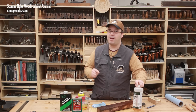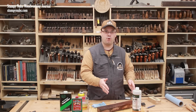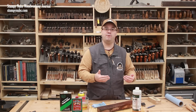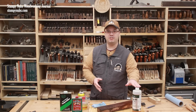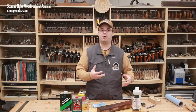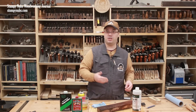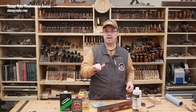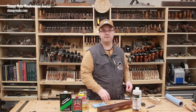Because they aren't talking about adding coats in layers to build up a protective film. They're talking about waiting an hour for that first coat to soak in, then adding some more of it until the fibers are fully saturated. It's not contradictory to what I learned, it's just confusing. This bottle describes essentially a multi-step process of applying what really should just be called the first coat. If you apply after just an hour, you're merely adding to that first coat. You're not adding a second one on top of it. The new oil will just mix with your hour-old oil that's already in the fibers.